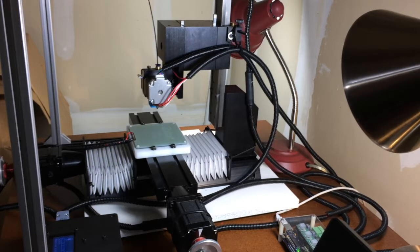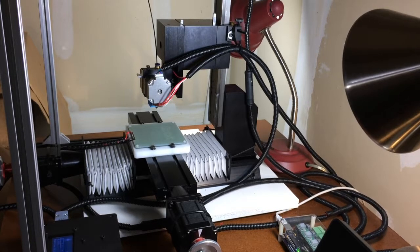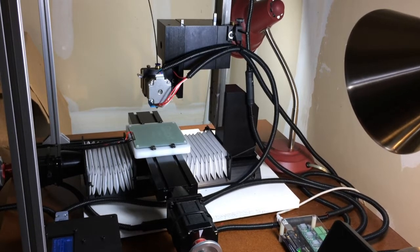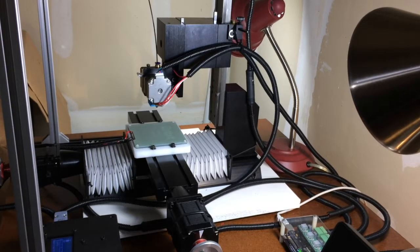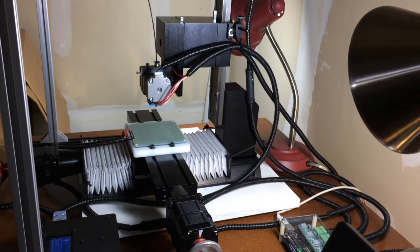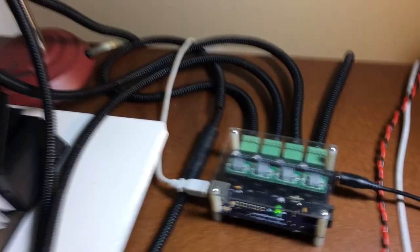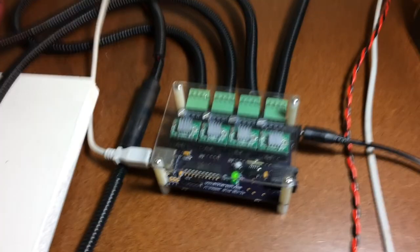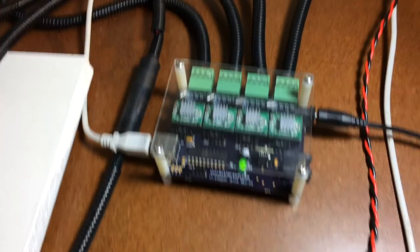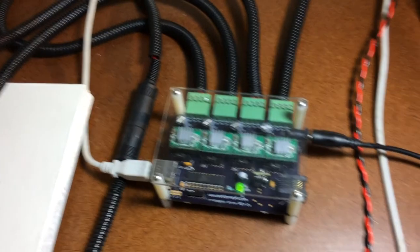Sherline only sells the printhead bracket and printhead saddle mounting plate. The rest of the 3D printer parts are available online, which makes this a do-it-yourself or DIY only project. Since all the stepper motors on the 3D printer are bipolar or 4-wire, I use the RT Stepper 4-axis motor drive board to drive all 4 stepper motors.